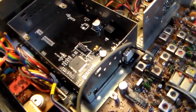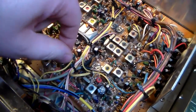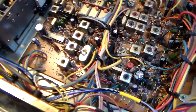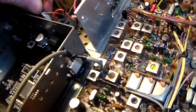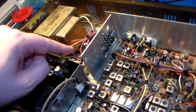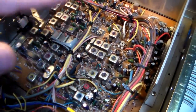Basically what I'm doing here is the microcontroller detects voltage present on the negative of the radio itself. If you measured from this can here, this crystal, which is strapped to this transformer, in relation to the ground over here, and just pulled the power out of the module, and you measured from here to here, you're going to get the 13.5 volts of the power supply. You're going to measure that, but the radio will be off. So in other words, this is basically switching the negative.